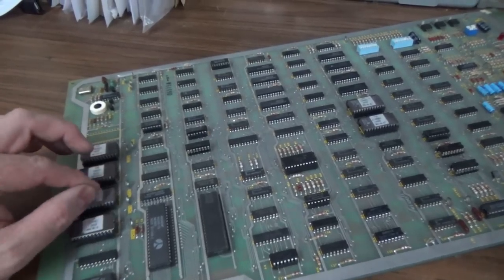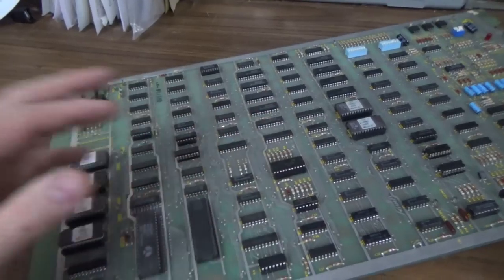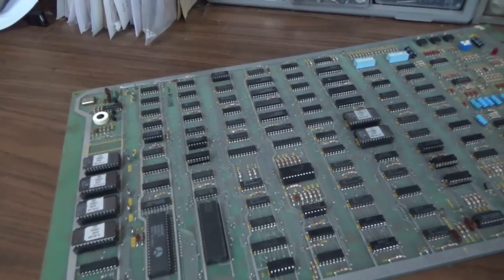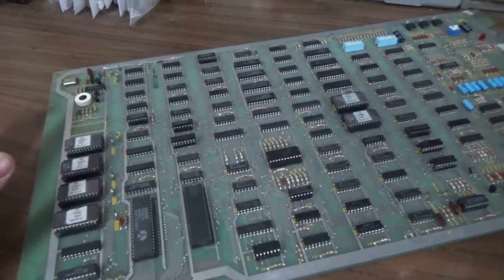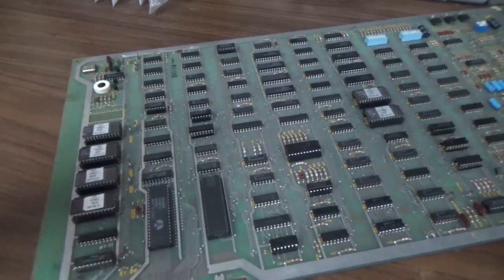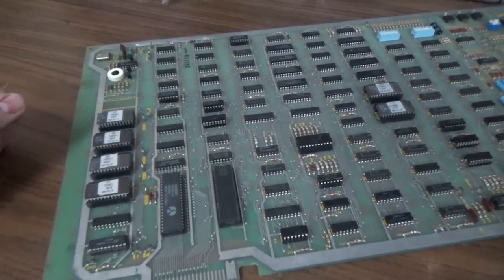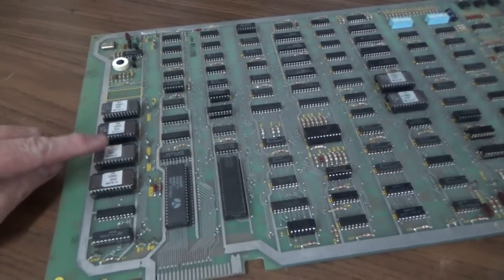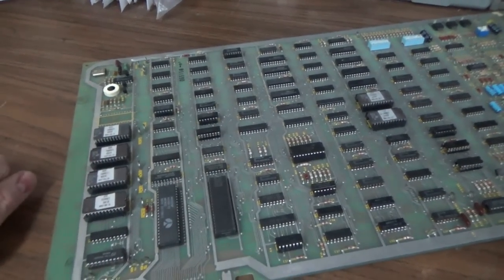Some of these Ataris have bad sockets. If you look, the socket doesn't look very good and it's filthy and isn't making good contact with the pins. If you get that kind of problem, you may have to swap the socket out. But we're just trying to make it as simple as possible so you can understand some concepts of repair and so it doesn't sound so overwhelming to you, right? So clean your chips. You got the power supply right. Check the board and see what it does.